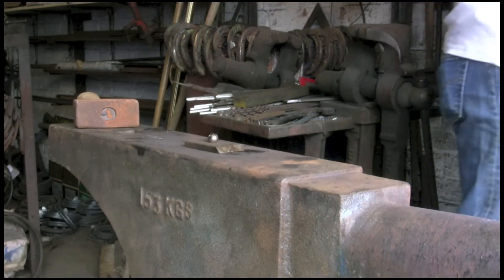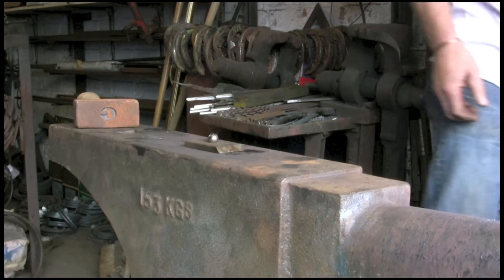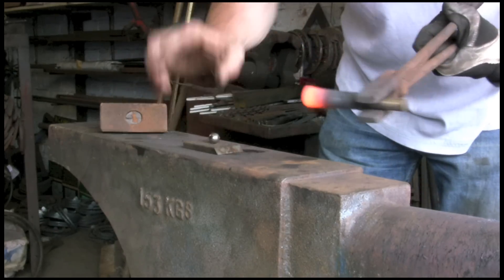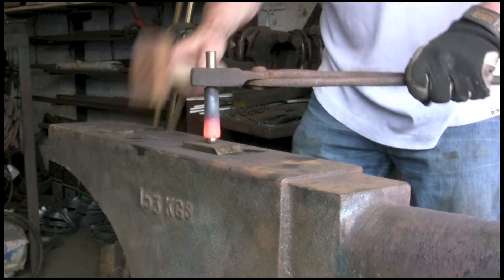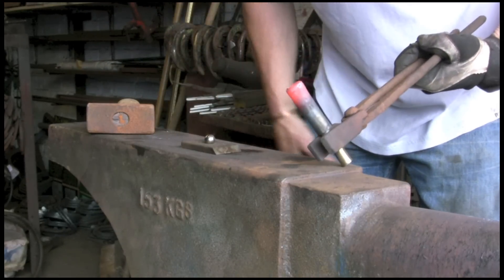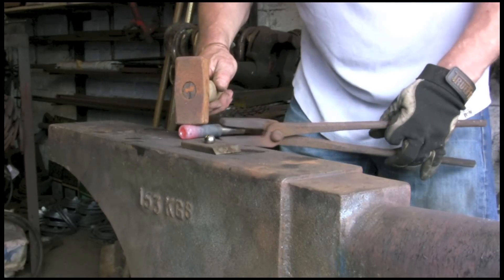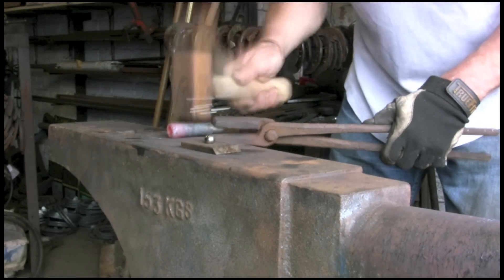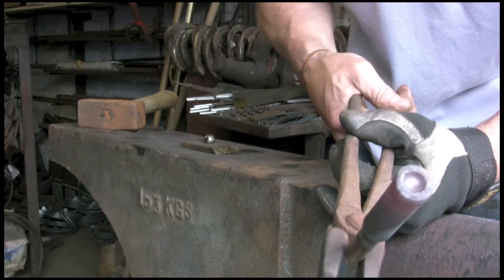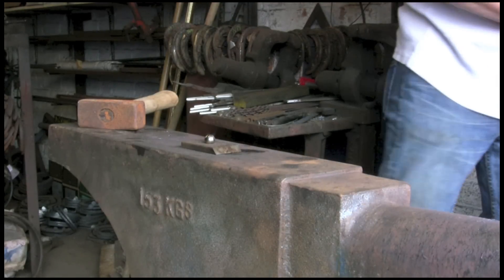Let's try again. It's a bit shorter — we've got a couple of good hits. That is very hot, but it's getting there. Still a bit out of shape — straighten it up again. Quite important to keep this fairly straight. You can see it's starting to put a nice dome in there, not quite in the middle, but pretty close. Give it another go.